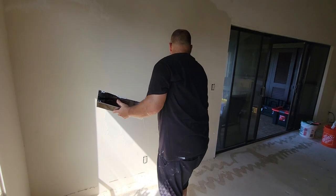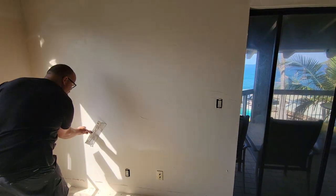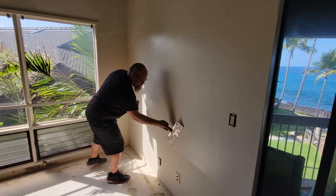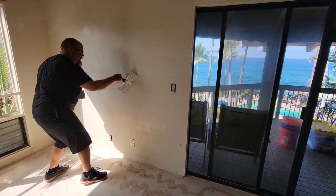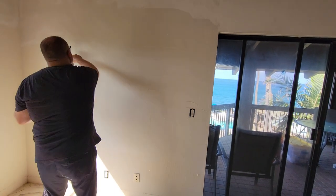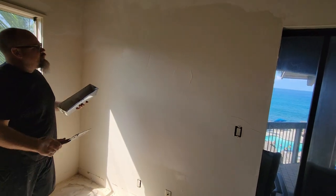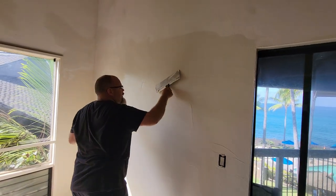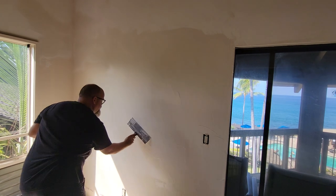What I'm doing now is going in an organic pattern so the human eye doesn't pick up that this was done in a repetitive pattern, like a lawn mowed in rows. I also like to reach — I don't start right at the mud edge, or I'll put a line right there. I start beyond where I did the mud and then lift the trowel off like a plane taking off — gradually bringing it off that line.